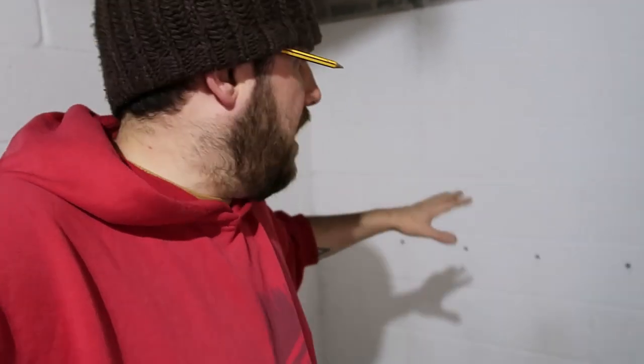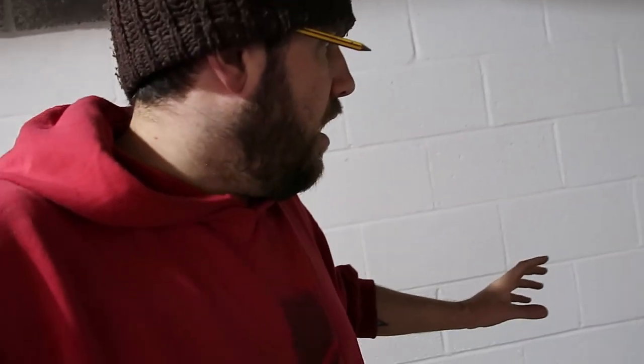This is really just for holding it in place, holding it tight up against the wall, and taking a little bit of the downward force, so that's mainly going to go through the feet at a 45 degree angle. So none of the biggest screws are going into the wall. At this point, we'll have some big anchor screws going in down the bottom.